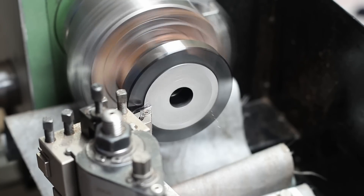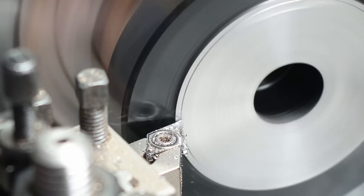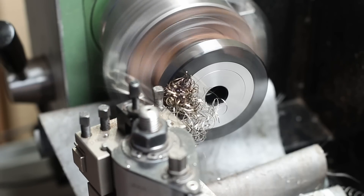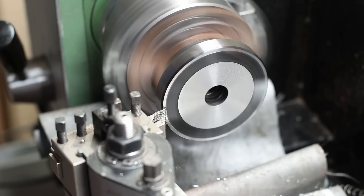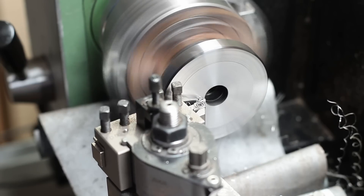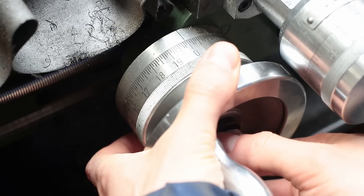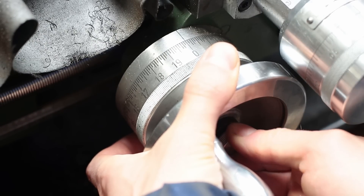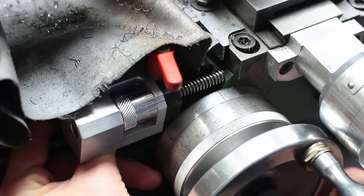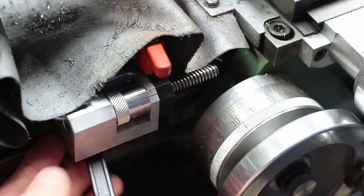The steel feels a little bit tougher, but it's still pretty machinable. I used polished carbide inserts for aluminum, which work great in hardened steel too, but of course they don't last as long as when cutting aluminum or brass. For cutting the recess for the spindle nose, I used the bedslide dial and the adjustable carriage stop which I made in the past. Both are a great help for repeating cuts to the same length — there are videos on both builds on my channel as well.